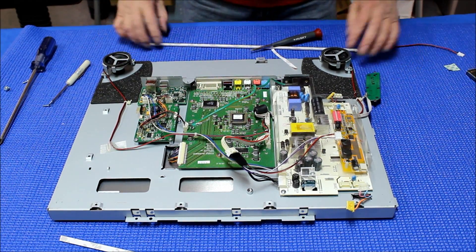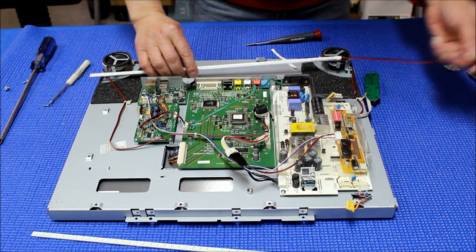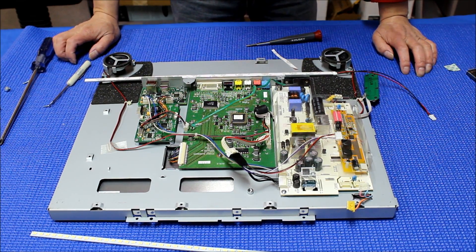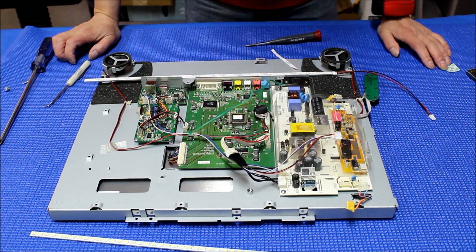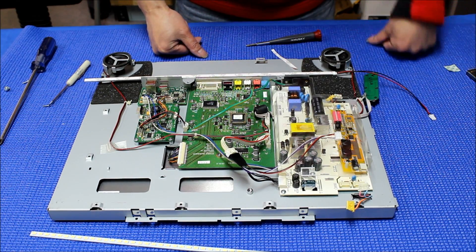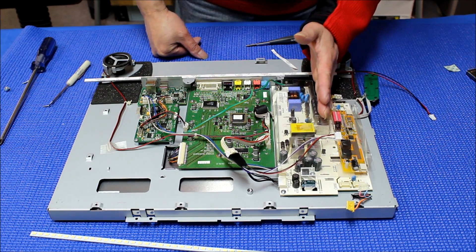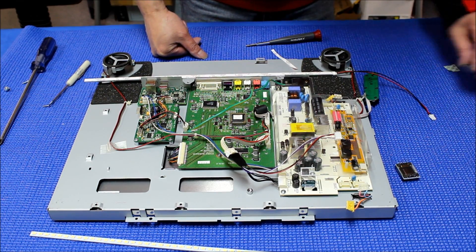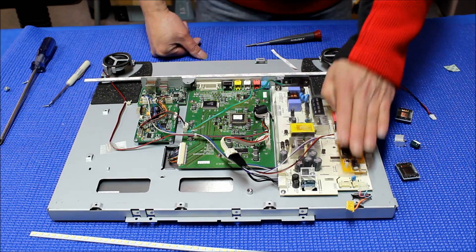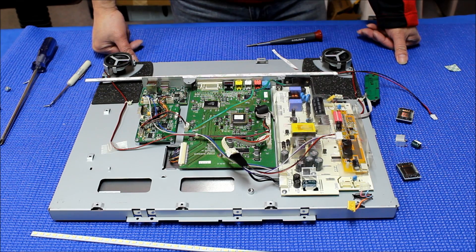For this ELO screen, take the screen out and install the two LED strips, with the wire coming out from here — just connect it. So again, with a LIPS inverter, it's not as easy as a standalone inverter in terms of mounting the LED driver. But all you need to do is remove some components, especially the transformers, to create enough room to fit the MS456 LED driver. It's not that difficult. Thank you for watching.